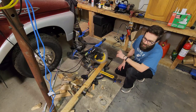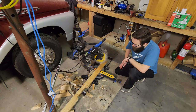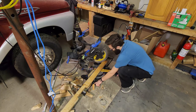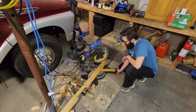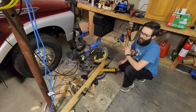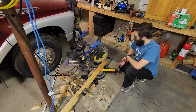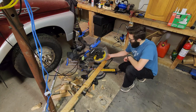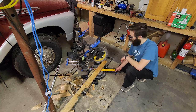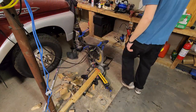My favorite angle when building a picnic table is 31.6 degrees — that's just one of my saw's quick easy settings where it clicks into place. That's basically the angle I use on every single part of this picnic table. First up, we're going to cut an angle on this side so you don't have a sharp angle right where the legs go in. A nice 31-degree cut there — and it's about to get noisy in here.